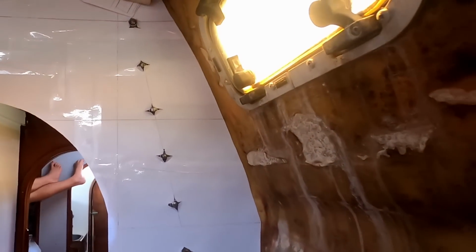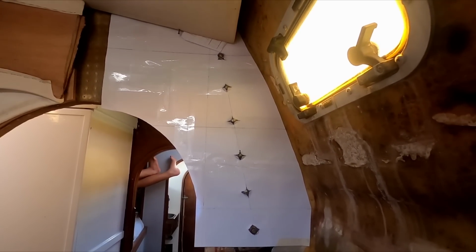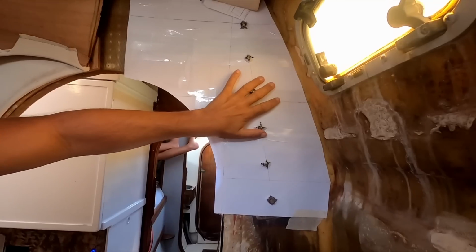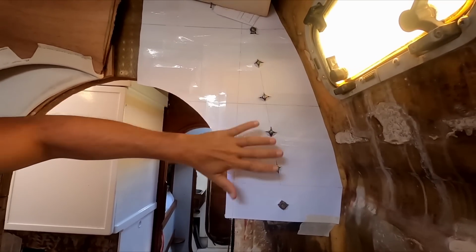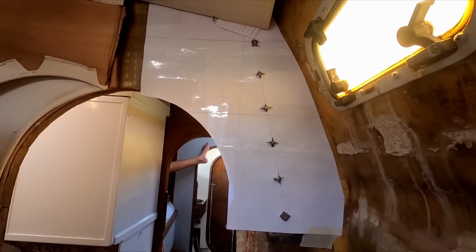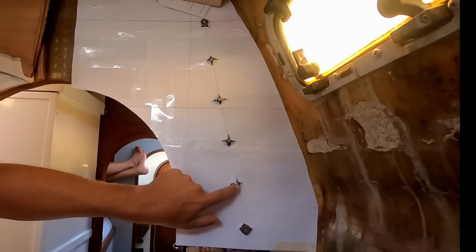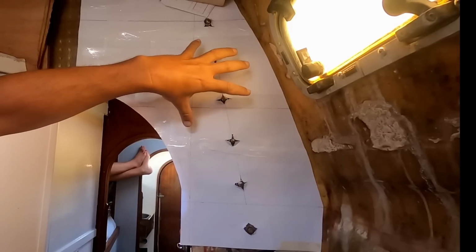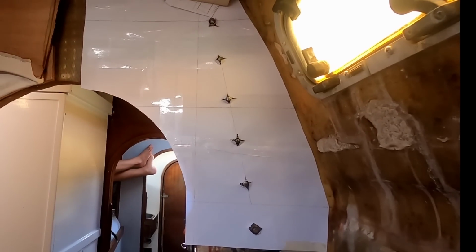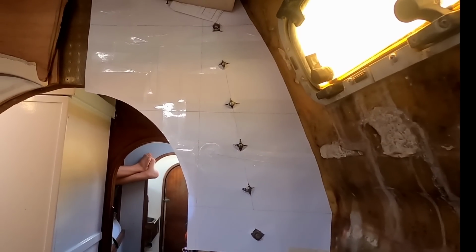So tell me, if we're going to wet laminate some carbon onto this bulkhead, why do you need a template? Because we're actually going to replace this part of the bulkhead. I'm going to make a new piece of bulkhead, which is going to be the white thing here, and I'm going to laminate the chain plates to the replacement bit of bulkhead. And then stick the whole thing in afterwards. Now I know what you're doing. I have my reference lines of my old template in relation to the actual piece that comes in and out, and where the new one will go, and the reference heights and all that sort of stuff now sorted. So when I build the new one, it will go where I intend it to go.